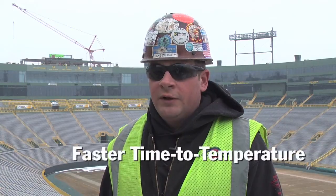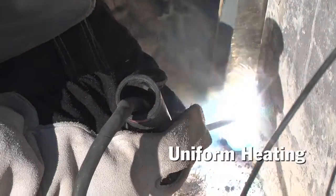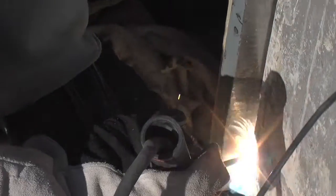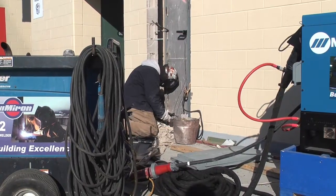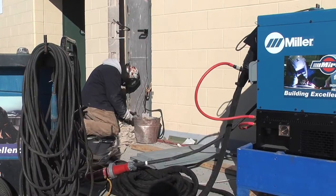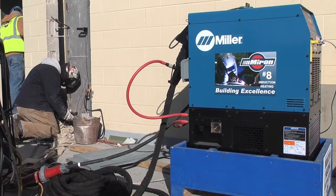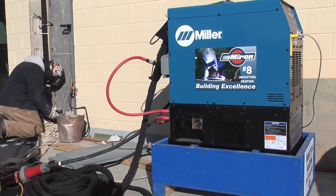On our bigger plates, the induction unit by far heats up the plate faster than using a weed burner or a rosebud on a torch. It's been very important to have an even heating system, because if you're welding on the plate and trying to heat the column at the same time with a weed burner or torch, it's very hard to keep the heat consistent. From an inspection standpoint they're worried about cracking the welds, but with this induction unit the heat flows right through the plate evenly and heats the column evenly.